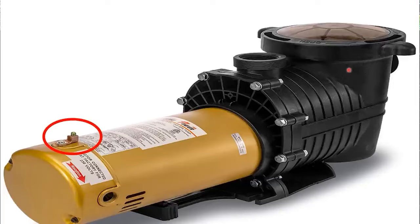Now let's take a look at heaters. On a pool heating system there's a ground lug present. There are provisions in the code where you do not have to bond some heaters — you'll find that in NEC 680.26 under pool heating systems and circulation systems. I encourage you to read the entire section, but just assume your heater needs to be bonded, especially if you see lugs present. Pull out your instructions and paperwork to make sure you're following the manufacturer's instructions.